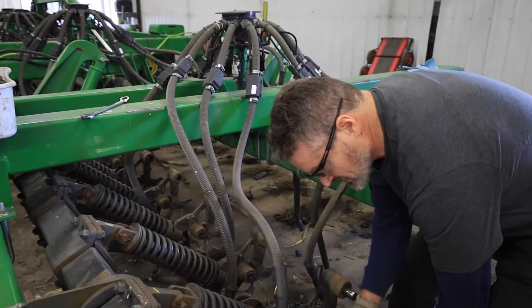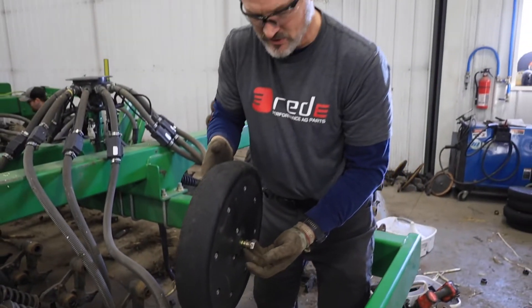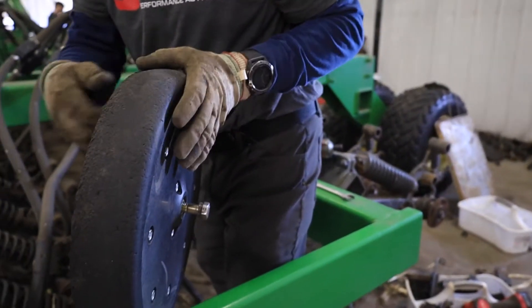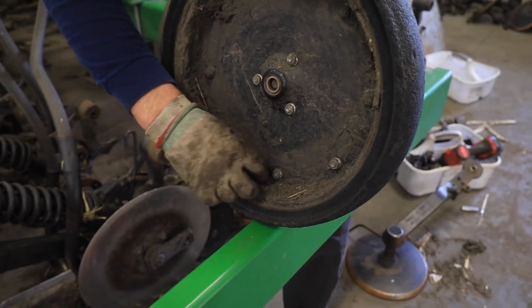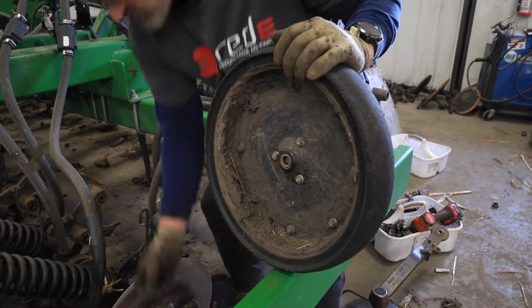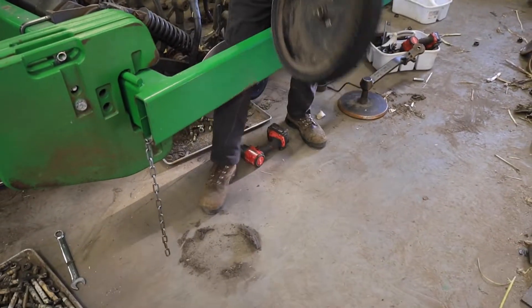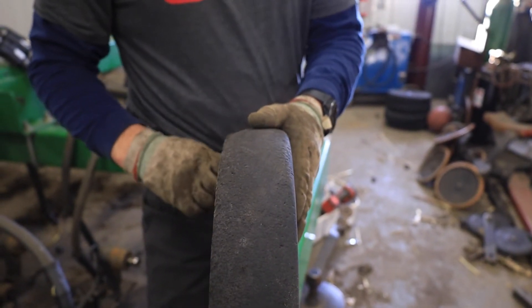That spacing is set between the gauge wheel and the disc. As you can see, we have these washers on the outside — those are the spare shims that the farmer can use to put on the other side and make adjustments. With the gauge wheel off, you can see these are the shims that were on the inside, physically setting my spacing to the depth arm. Capture these and make sure you don't lose them. One thing to note on this gauge wheel — it is getting some wear and stubble damage along this edge, and at some point the farmer is going to want to start replacing those.